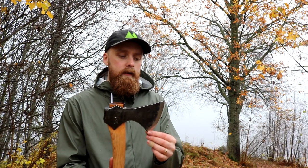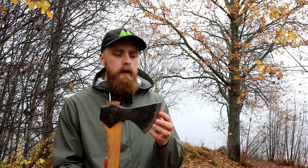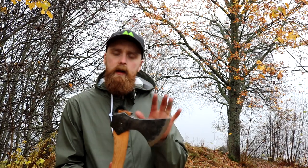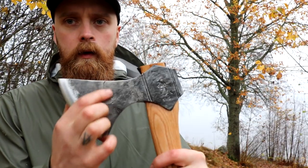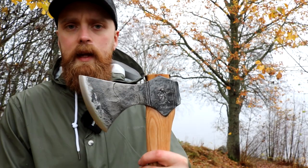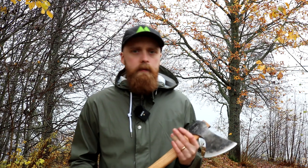So anyway, I did the unsymmetrical fold. I also had, let's see, what kind of steel was it? It's C45 edge steel, forge welded in. I did that in the beginning before forging the eye, and if you look closely, you can see the cleft still visible here. Now this is not a delamination, this is a trace, and there's a big difference.